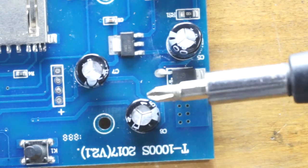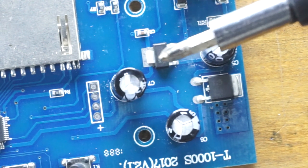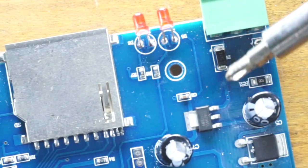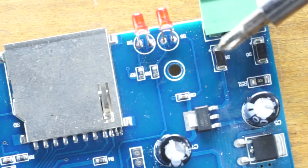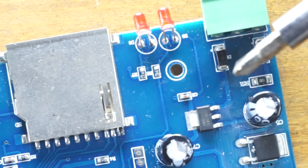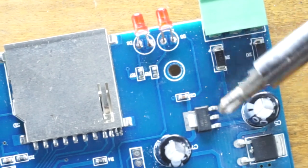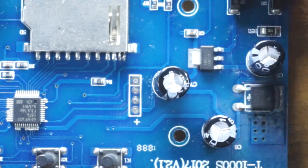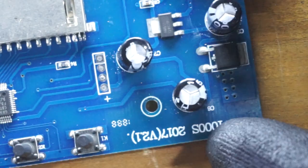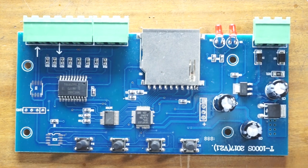This is the smoothing capacitor for the 5V trace. This 5V line also supplies power to the TL1117 3.3V linear regulator IC. Looking at the 5V power input line, they use the same diode for reverse polarity protection but there is no current limiting resistor. That 5V input connects to the TL1117 3.3V regulator's input and also connects directly to the 5V power trace of this PCB.